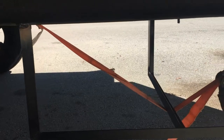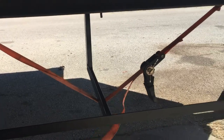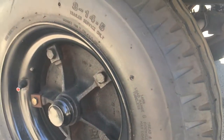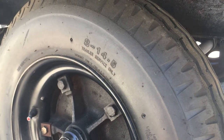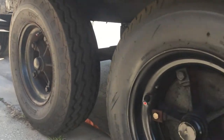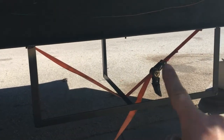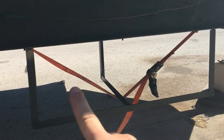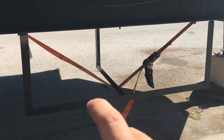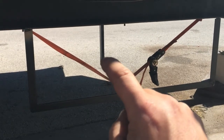As you can see, I built the bracket out of angle iron which is one inch and 1/8 thick. I cut it and bent it so that this 8-ply, 14.5-inch tire — 8 inches wide — fits into that slot. I measured both tires and came to 27 inches in diameter, so I designed the gap to be 30 inches in case one of the tires is bigger. The height is 10 inches, and as you can see I'm pointing out that the tire will rest in the backside pretty much two-thirds in.